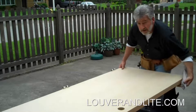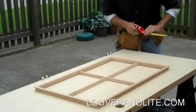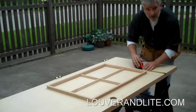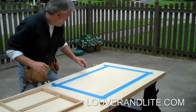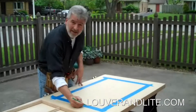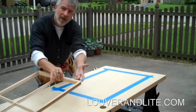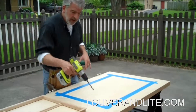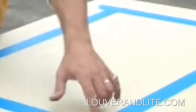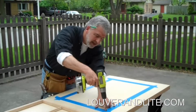It's also important when you're putting your saw horses underneath — make sure the door is in the air where you're going to be cutting, otherwise you'll cut right into the saw horse. I made all the measurements for the back side, so I had the tape below when cutting through. This time I'm going to make the measurements, tape it, and then put the top light on as the template. Because you're using the light as a template and you've sketched around the unit, keep in mind you want to cut to the outside of the line with your jigsaw so that it's not too tight in the opening — you've got a little play because you've got the frame around the light. Now we're going to drill a hole in each of the four corners, because we need to drill holes so we can get the jigsaw blade in to cut all the way through. Drill right in the corner using the cross as the center for the drill bit.